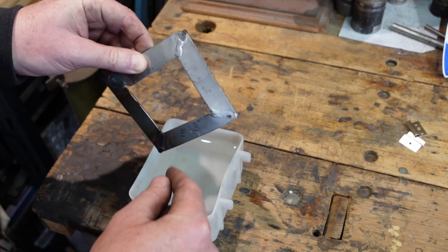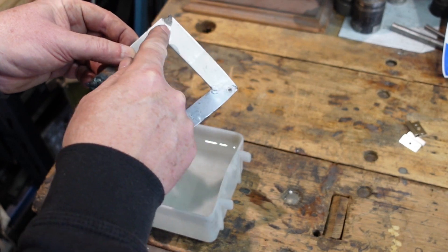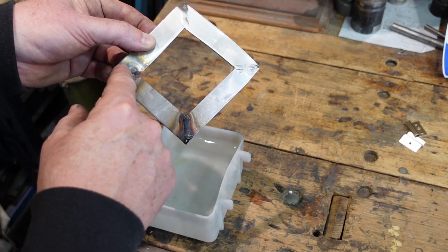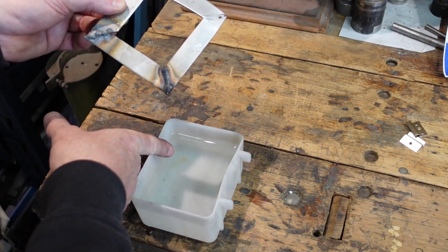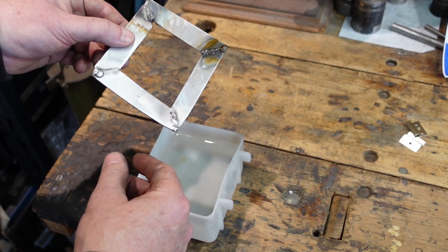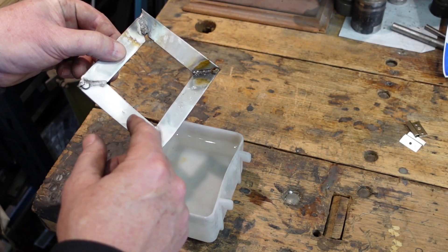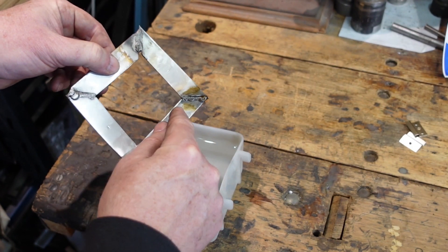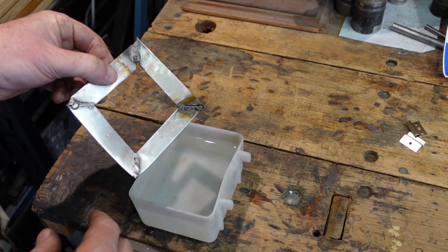This is the passivated side. On the side that I didn't brush, the passivated dry and passivated wet look very similar. On the side that wasn't passivated, it's difficult to tell, but this area has got a little bit of shine to it and this hasn't, so I'm suspecting this is starting to corrode. And interestingly, down in the corner there's a little bit of a rust stain. On the other side where I gave them a wire brushing before passivation, the passivated side is showing no signs of rust staining at all.